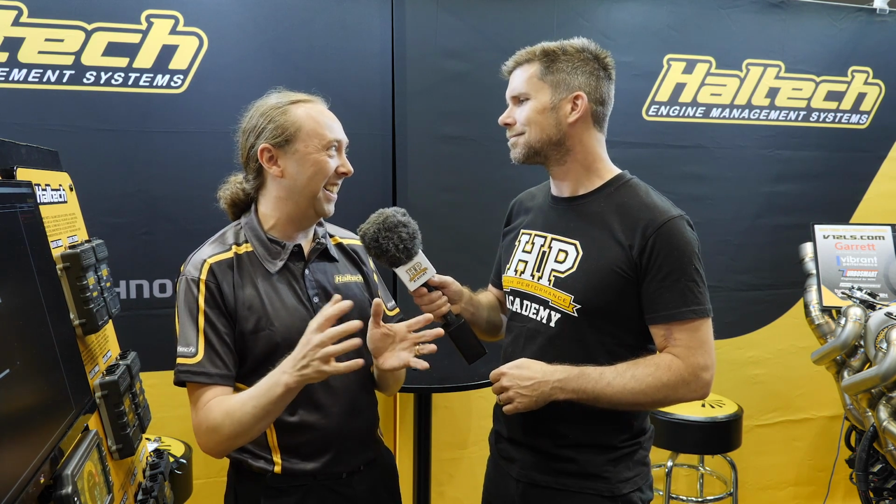Well, there's certainly technical risks, and they're ones that we identified very early and did a lot of testing on. The engineer that designed a lot of this for us, his background's in power distribution. He designs things like substation transformers to last for 60 years, so he's very conservative with his design, which is good. We're calling them 25 amp outputs. Actually, they can handle a lot more than that. That's just what he's happy to put on them.